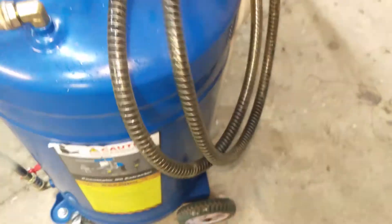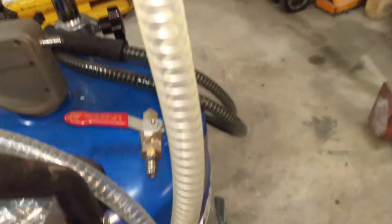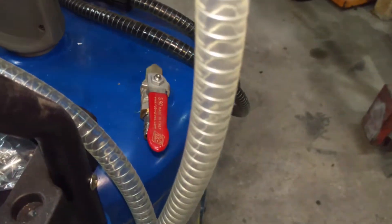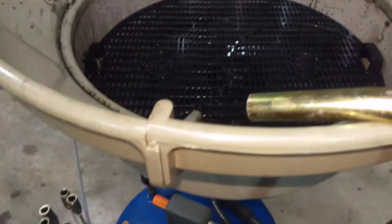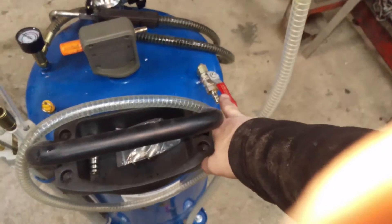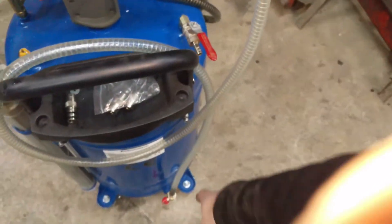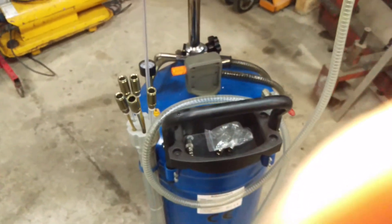You can open it up and let it drain into the tank. Obviously when you're draining into the tank, you also need this one open, because that allows the tank to vent up here. I also leave this one open as an added vent, because as the oil goes down, if the seal is too good, it'll just push oil back up this pipe and back through the top, which would be annoying. So I always leave that open as well — it allows the top of the tank to vent. I have all three valves open when I'm just draining oil.